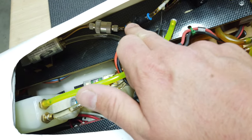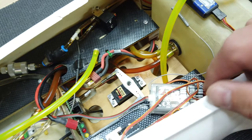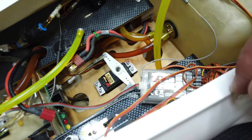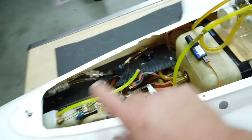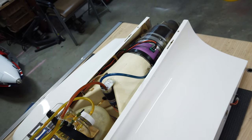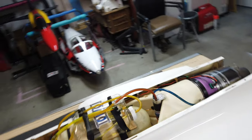One of the differences between this Jet Cat engine and the King Tech engine is the number of fuel lines. The Jet Cat has the solenoids installed up here, whereas the King Tech engine has the solenoids installed under the front cover — meaning only one fuel line goes to the engine. We're going to take all those components out: the solenoids, the on-off valve — which we'll reuse — the fuel pump. We'll talk about the UAT and the fuel system in general as step one.